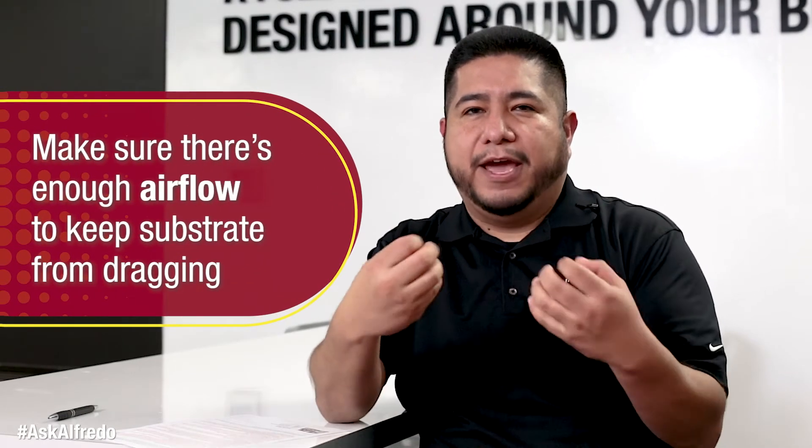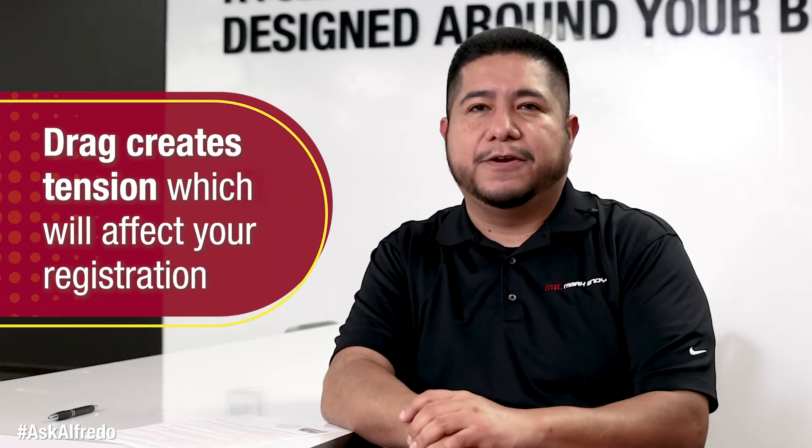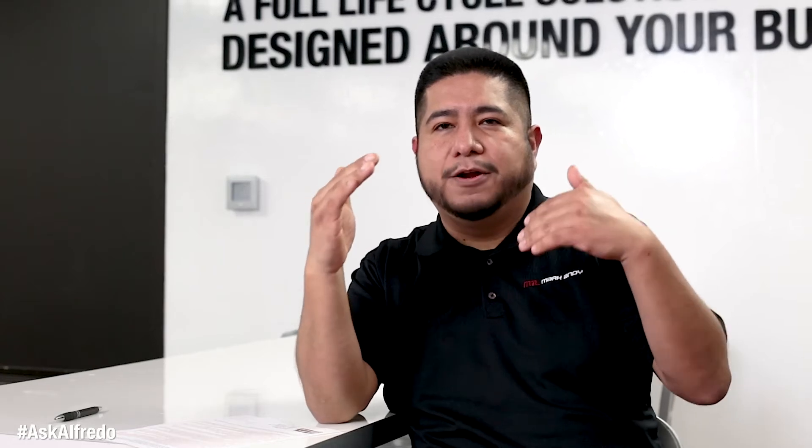Your turn bar is a standalone unit. Every crossbar has a series of openings, which you put a screw in or a cap. If you do not uncover enough of those, you will not have enough air flowing underneath your substrate and it will drag. When your material is dragging, you'll see a variation in tension while you're running, and that will affect tension throughout your entire press and affect register to every process. Make sure you're opening up every hole underneath your substrate from one inch to one inch from each edge all the way through.